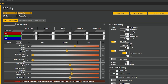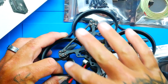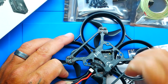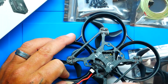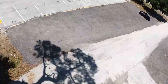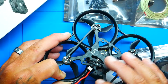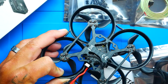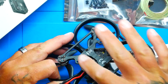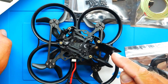This is tuned to fly perfectly as-is with this setup, battery, and all — it's going to fly and handle amazingly right out of the box. On board we have an F405 20-amp AIO flight controller. You've got two BECs: a 5V 3A and a 9V 2A. The MCU drives the gyro, which is an ICM 42688P running at 8K. There's onboard ELRS 2.4 that I'll bypass, and the built-in ESC uses the BB51 chip running BlueJay at 48K.